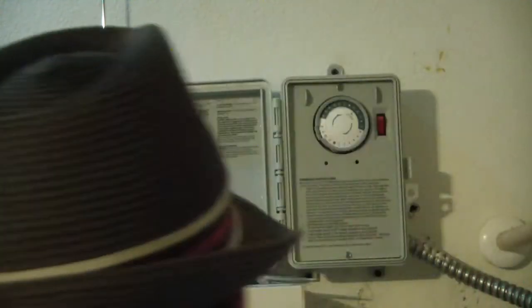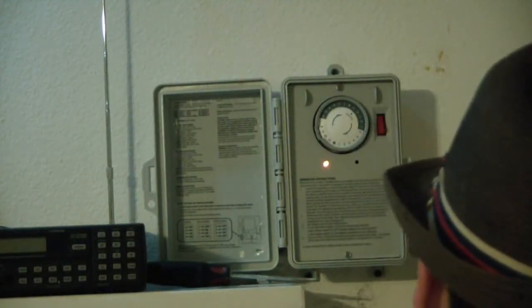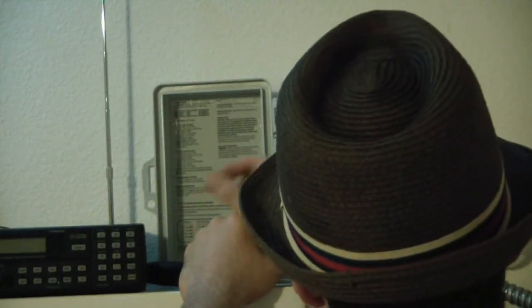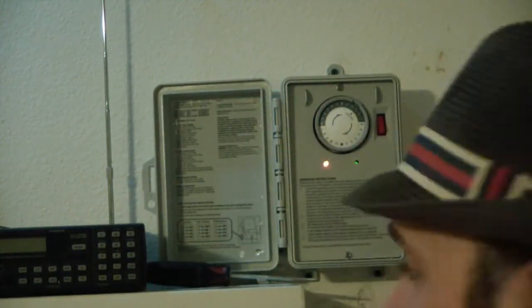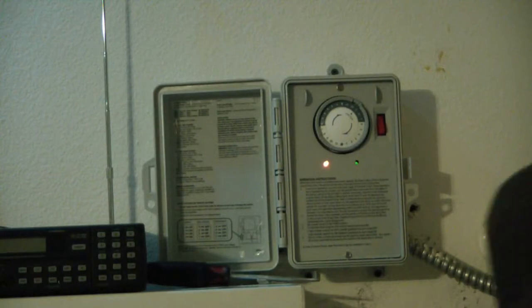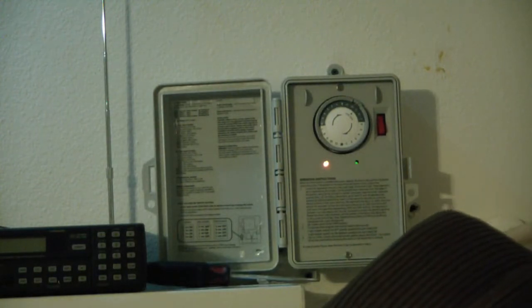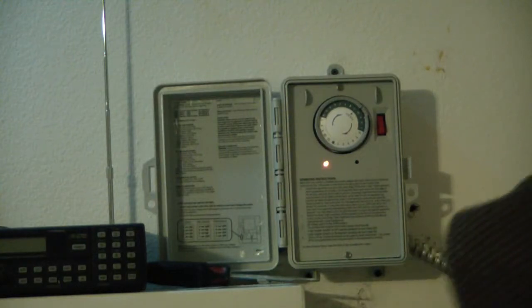On this particular one, to turn the timer on it goes all the way to the top. Give it power. It says power. Time now is pointing to 11. I'm going to turn it on and it should turn on that relay — we should hear a click. There it was. Status is on. So it looks like we got this thing working. I see 226 volts. Turn it off and it should go off. I see nothing. The timer works.